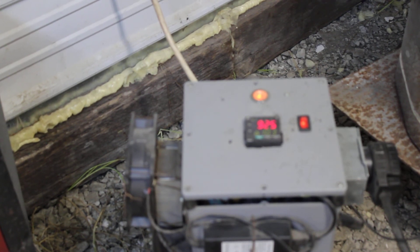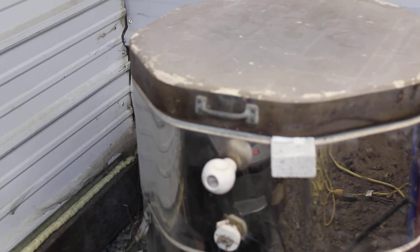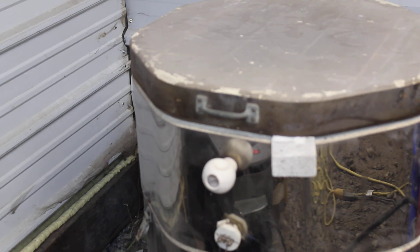On this blank I wanted to touch base on where we were in the process. Those of you on the Telescope Makers forum have seen some mirrors I've been working on that I cast myself — this is how I did it. So right now we're degassing the mold and burning out the organic binder in the liner, and we're going to cast a borosilicate, aka Pyrex, blank. Thanks for watching.